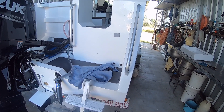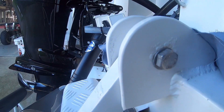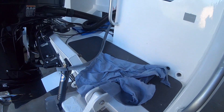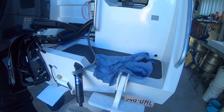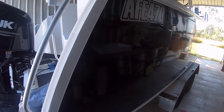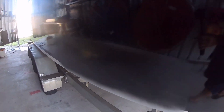Electrolysis is starting, but only in the places where you would expect it to be, like around your stainless fittings. You can probably see that paint bubbling in there. It's sort of nowhere where it shouldn't be, like in the floor around the hole, but the paintwork and everything seems to be holding up except for that first bit there that we had a bit of drama with — it's all holding together.